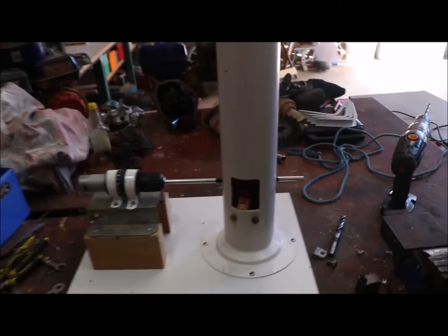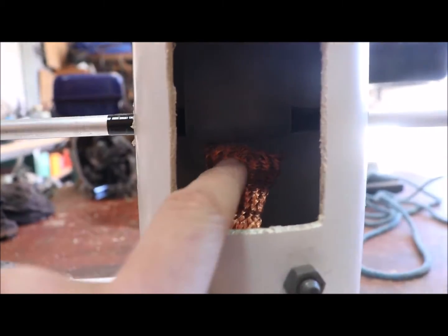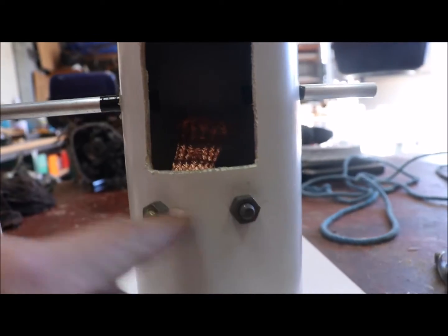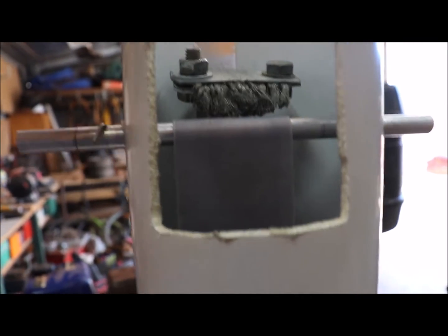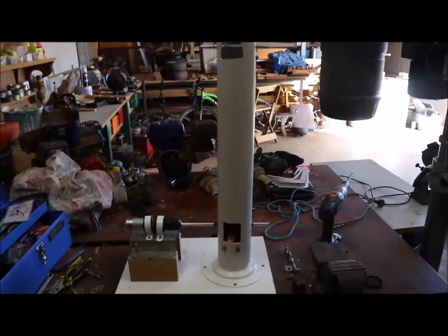Now the brushes are on. The welding clamp copper braid is positioned so the end of the brush is right next to the belt but not quite touching it. It's clamped to the side with bolts, and underneath it's connected to a bit of aluminium tape, which provides a good contact with the ground — that's where it gets all the electrons from to push up into the belt. That's the bottom brush. At the top, I used the brush from the motor, cut it down, clamped it together, and it's sitting just right above the belt — not quite touching, but right above it.